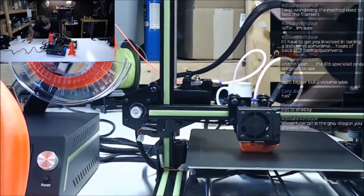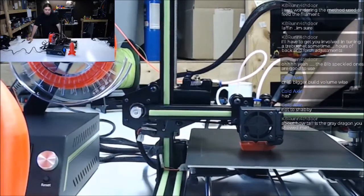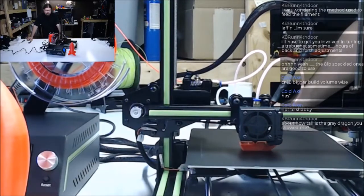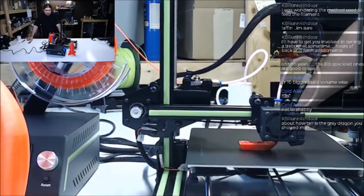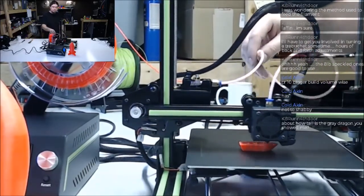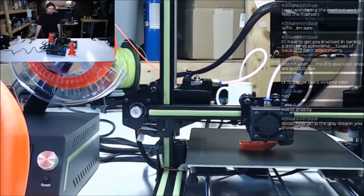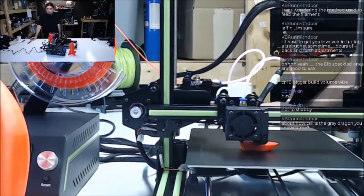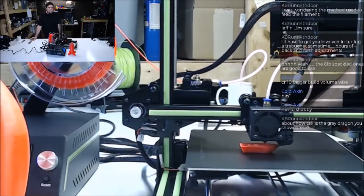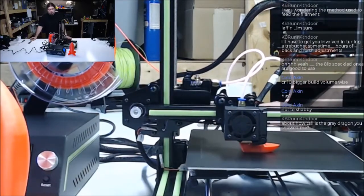The wheelhouse is kind of looking like crap. You can see that filament moving side to side in that Bowden tube. That means the Bowden tube's too damn big. So we'll have to get some actual 2 millimeter, 4 millimeter tube on there. That's that odd size stuff. It's probably the same stuff that's in the barrel that I don't care for.